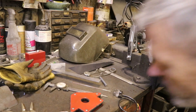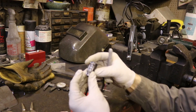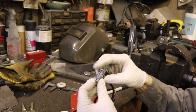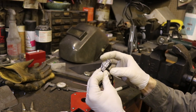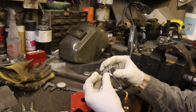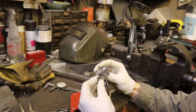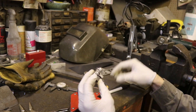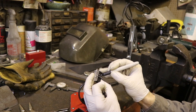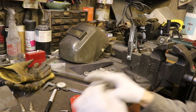So we've got this guy on here - it's nice and bent, it's almost like a little heart - and it goes on here like that. Now I just basically need to mark and cut it where it theoretically meets up with this guy, which is right about there. So right around that black line we should be cutting this thing, and then we'll weld it on to the box.